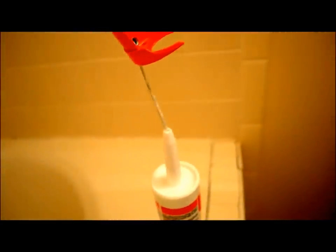I've started laying the caulk down, just going along the corner at a nice steady smooth rate of speed. Beat it up a little bit in the corner and come around. I have to do this quick because I have to come around with the tool next to even it all out. I've got caulk all around the tub now — just a bead.